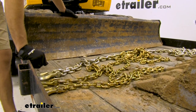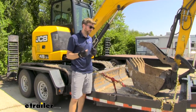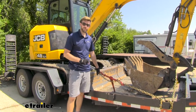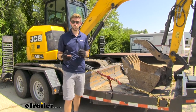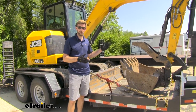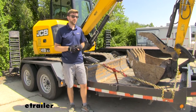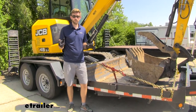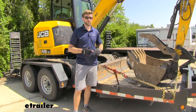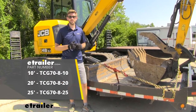After a while, with chains holding loads down and rubbing against one another, you can start seeing signs of wear — not a safe way to go. In my opinion, if you pair this style of chain, a smaller diameter one, with a binder that matches it — the chain was 4,700 pounds and the Titan Chain binder is a 5,400-pound working load limit — go with whichever of those two numbers is lowest. If you use the proper amount of chains to handle a heavier load like we have today, it's a much easier way to go while still maintaining a safe towing weight. And if you want to go with those larger chains, totally a good way to go too — I personally just like a few more smaller chains versus really long, heavy-duty ones that are more work to put in place. That's going to do it for our look at the Titan Chain Transport Chain.